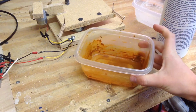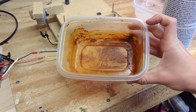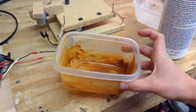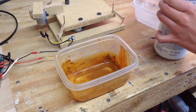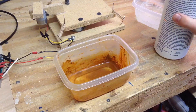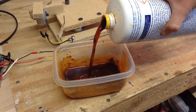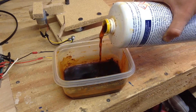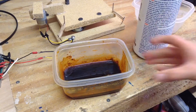The first thing that you're going to need is an old container. This container previously contained ferric chloride from my other circuit board etchings. I'm going to take my bottle of ferric chloride — be careful because this stuff is corrosive, don't get it on your hand. Pour it inside here, about two to three centimeters. And as you can see, that's just about enough.